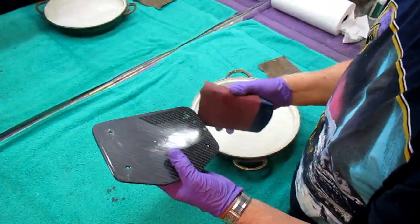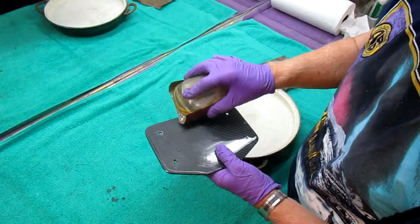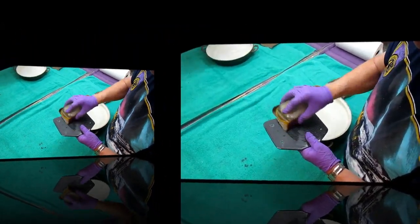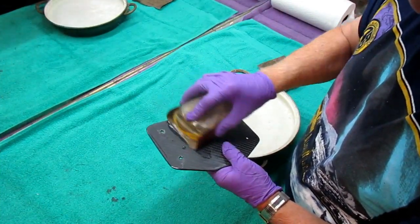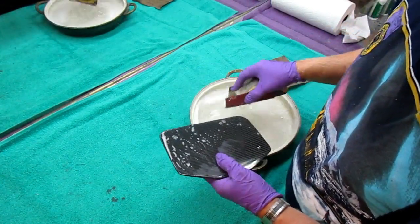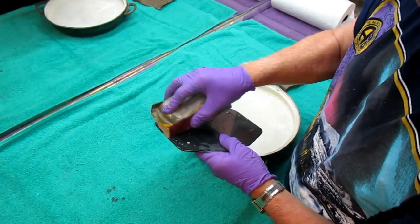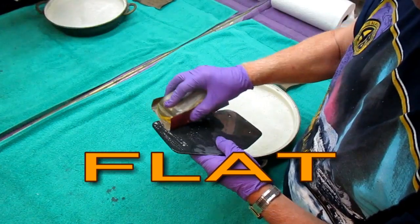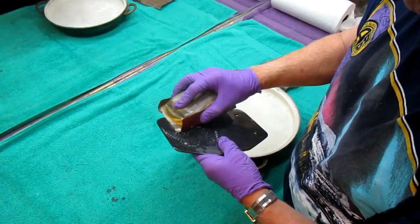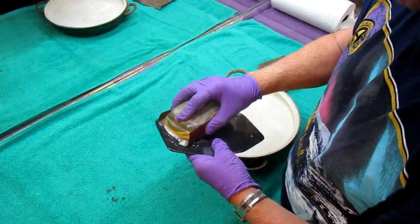And now that I have these cutting edges, now I want to look for any spot that still has a little moon crater. And I call it a moon crater. And now I can concentrate with a newly cut edge. Again, I don't have to worry about the middle of this too much, even though I'm just doing it for my own, actually, it's my own pride in product making here. I don't know if that's the right word. But it's so important to get the part flat and not have any imperfections before you start buffing, because the buffing operation should go very, very quickly. This part of it, as I said out in the garage, can be labor intensive.